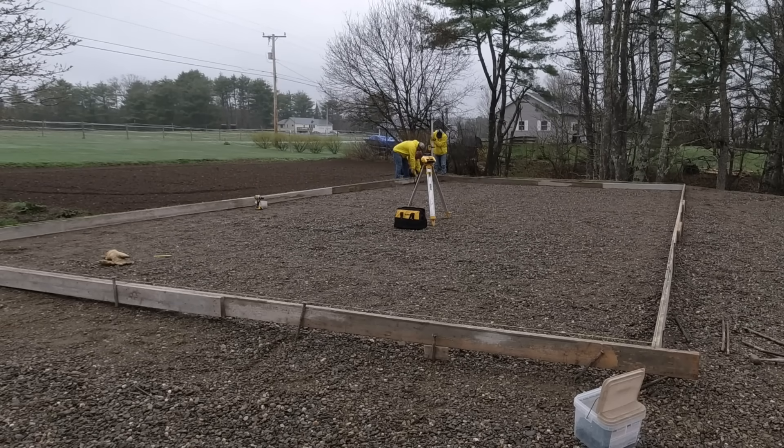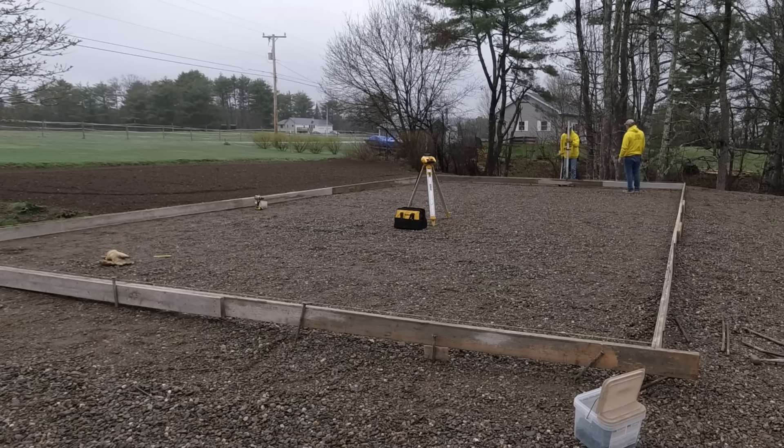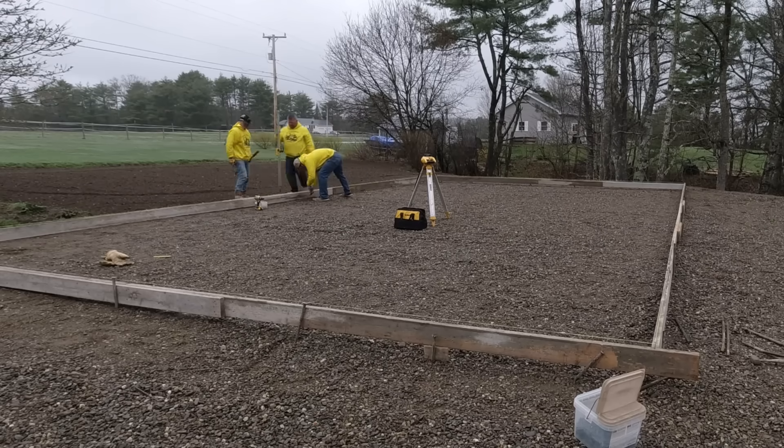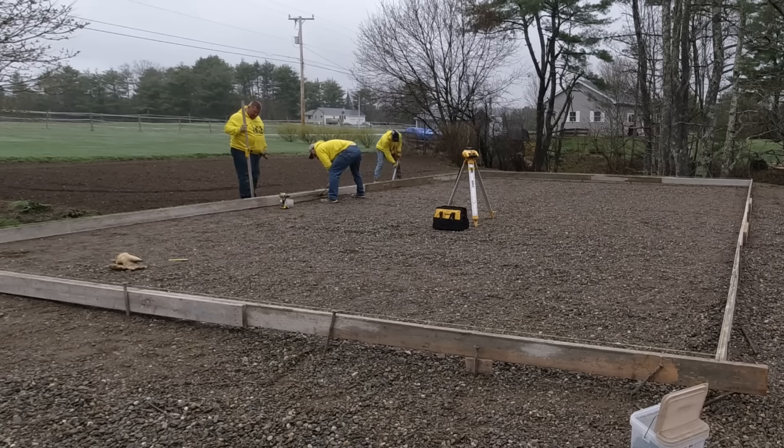As you can see we're using a drill driver, and I like those 2.5-inch deck screws — the T25s. Those hold the forms really tight and they're a lot easier to strip afterwards. You can reuse them over and over again. I know they're a little bit more expensive than nails, but we'll get 10 to 15 uses out of one screw as long as we're careful. So we go around, lift the boards up to grade, or if we have to dig down the gravel in a little area to move the form down, we'll just dig under the form. We like getting everything set right to top of grade if we can.